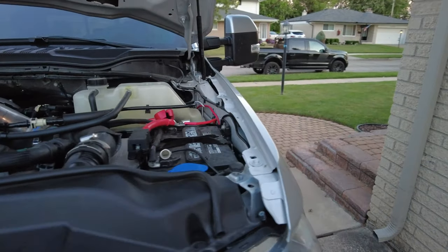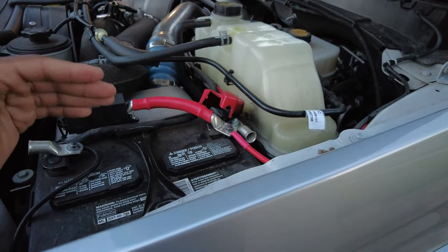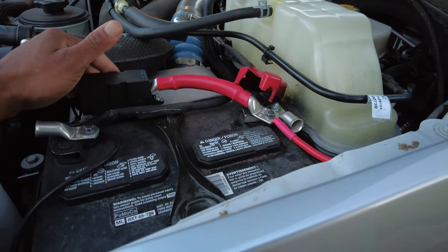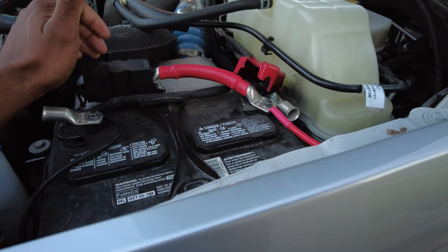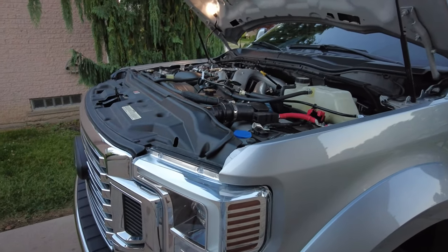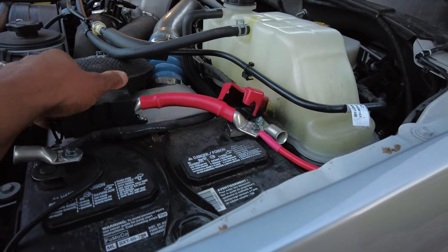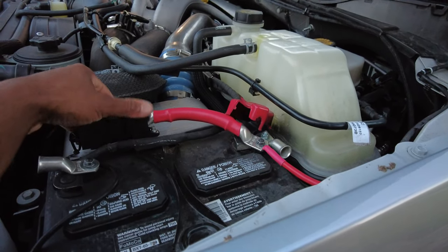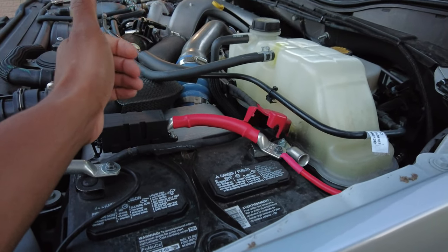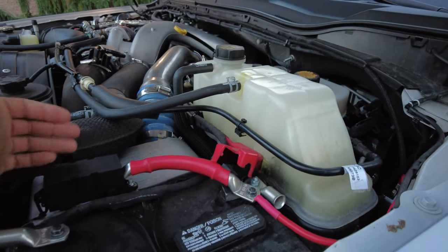Because I'm running 3000 watts, what I've really learned is that when you're running a 12 volt system for power inverters, you need heavy wire. If you're running a 24 volt system you can get more power out of your inverter and it's a little more efficient and uses thinner wiring. We have 4/0 wire which is recommended for a 3000 watt inverter because, while it is 3000 watts, it surges to 6000 watts whenever something electric is starting — like an air compressor starting up.